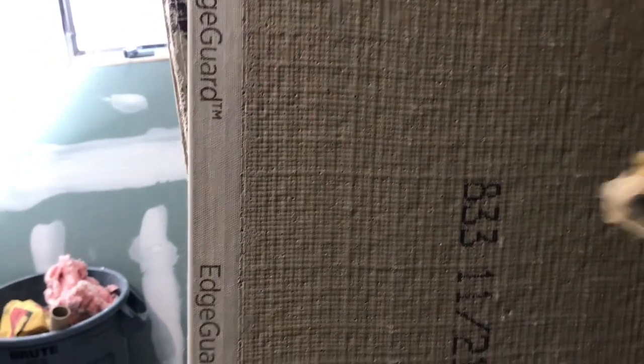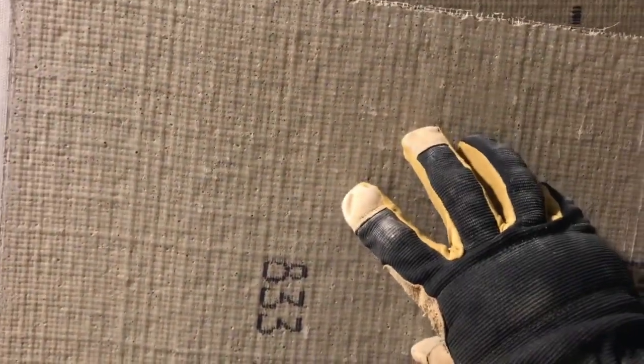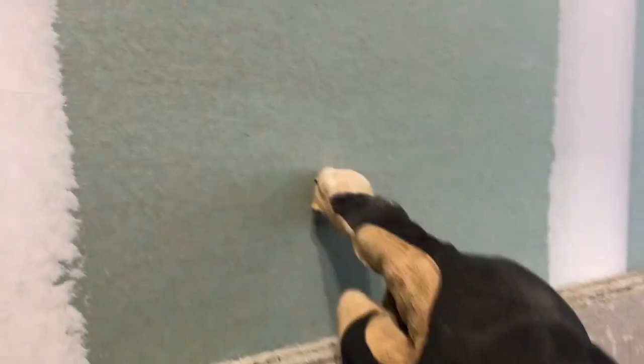You see all these little holes in them — all the little holes that are inside the cement board. I see them working like little roots for my waterproofing. When you put the first layer of waterproofing over this, it gets sucked right into those holes and it basically works like little fingers that are holding on to it, and then you're putting on your second coat that covers that.